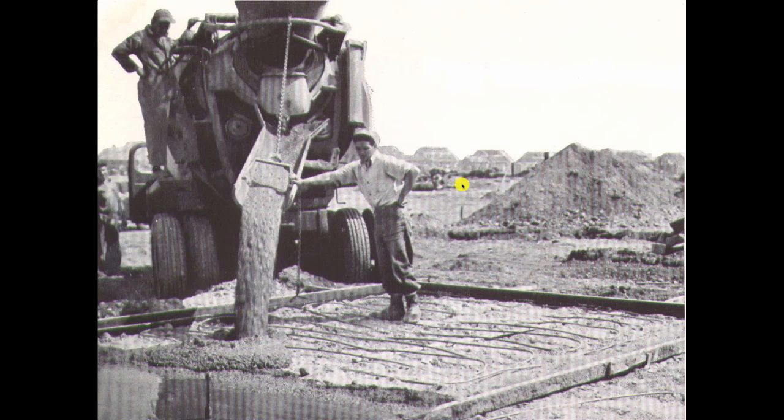They nailed the tubing to the wooden 2x4s to keep it from shifting, and then they just poured concrete right over that. And when those wooden boards cracked or rotted away from the soil that they were sitting on, because there's no vapor barrier underneath this, the slab would settle right where the wood used to be, and the tubes would begin to crack. So now we had a problem, because the floor would leak down, wouldn't leak up, it wouldn't show up as a wet spot on the floor, it would leak down into the ground, and the people would just notice that the heat's not right, and the water bill's going way up.